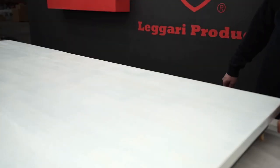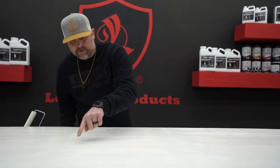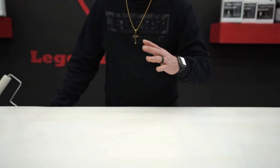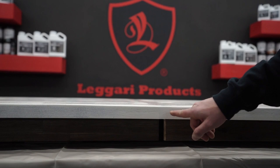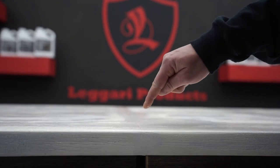I'm just worried about the vertical spot in this top corner. We want to make sure that's perfectly round. When you're doing Bondo, now I did the Bondo on this, so this is my fault, but I scraped it tight. You always want to leave it a little thicker on the top. Don't scrape it completely tight because after you sand, it kind of will settle in there. So we don't have perfectly flat lines here. And if this was a metallic epoxy pour, the metallics would settle in there and you'd kind of see like a ghost line. So whenever you're doing Bondo or filling seams, always fill them kind of high, and that's what I did on the faces. I just wasn't thinking. Like right here was overfilled and then sanded. It looks perfectly flat where you can see kind of like an impression there.